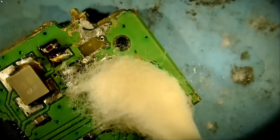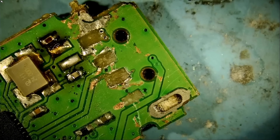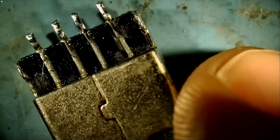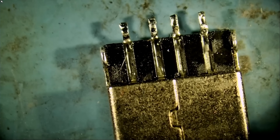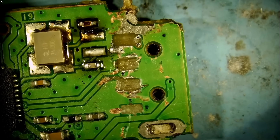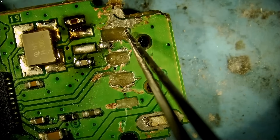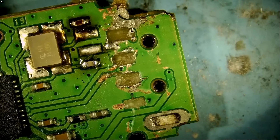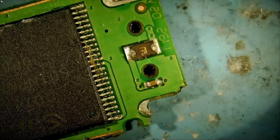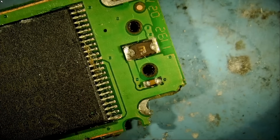Right now we're not seeing the glare from the flux because of the anti-glare light. All we see is an awesome image from this awesome microscope that we also carry in our shop. Let me grab a USB socket — I got one right here. We're going to attach wires onto that socket and onto the board. Why not add solder mask to hide the exposed vias? Or we can attach positive back to the fuse — let me measure it. Meter in diode mode. And the fuse is good. So we can attach the positive side of the connector here.